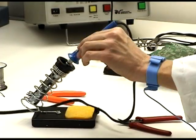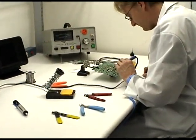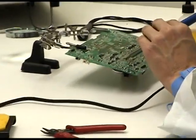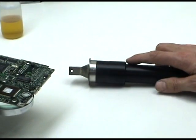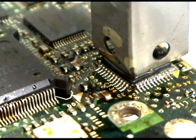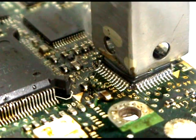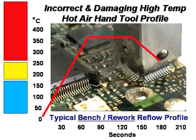Unfortunately, when PCB assemblies are being reworked or processed at the benchtop, in contrast with high-volume production equipment, the board assemblies are incorrectly soldered at the damaging temperatures of 350 to 450 degrees C — that is, 700 to 800 degrees Fahrenheit — without any ramp-up or preheating whatsoever, and this is simply wrong. Indeed, contact soldering irons should never be used with ceramic capacitors. Equally damaging is the benchtop method of soldering or desoldering surface mount components with hot air handjets without ramp or preheating. To compensate for the lack of preheating, the hot air handjets must propel elevated temperatures of 350 to 450 degrees C of hot air from its nozzle over the SMD. Not only do the elevated temperatures degrade the SMD beneath the nozzle, but the excessive hot air can reflow adjacent components next to the nozzle and/or on the other side of the board.